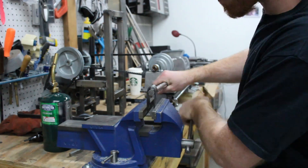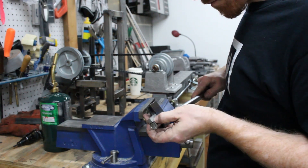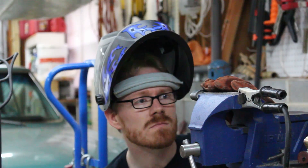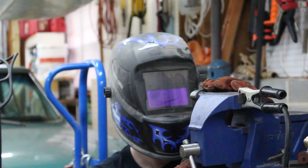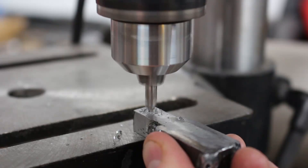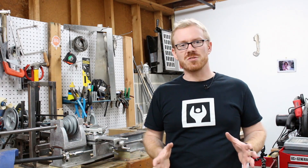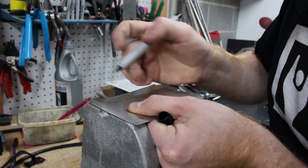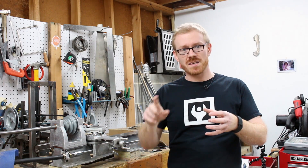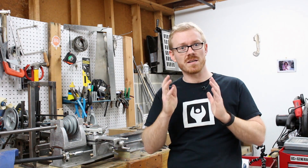Once I got it roughly bent into shape with the vise, I put the key stock into the band, roughly positioned it, and instead of fighting with drilling and tapping it for screws, I ended up just welding it — just tacked it in four places and it seemed to hold pretty well. Before I got too far into the boring operation, I had to fabricate some shims. The shims offset the bearing caps and give you the ability to remove them later to tighten down on the bearings.